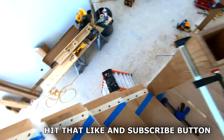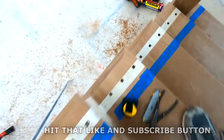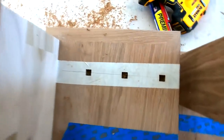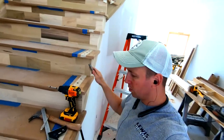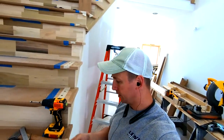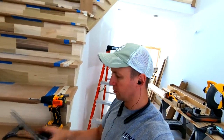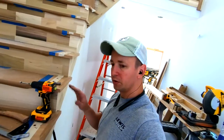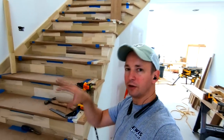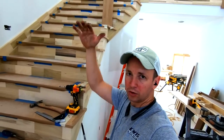There really isn't much to this — it's not rocket science. It's just a matter of taking your time and doing it right. Make sure everything's lined up before you go to town, and make sure you've got a sharp chisel and it goes pretty well. Here you have everything all finished up and square mortised on the treads. I'm going to leave the tape on the treads until after the balusters are installed to help protect that raw wood from adhesive. All you need is your Forstner bit, chisel, something to unplug the chisel, a combo square, and a hammer. Next step is to put the handrails back in place so I can measure for the balusters, cut them, and drop the handrail on.